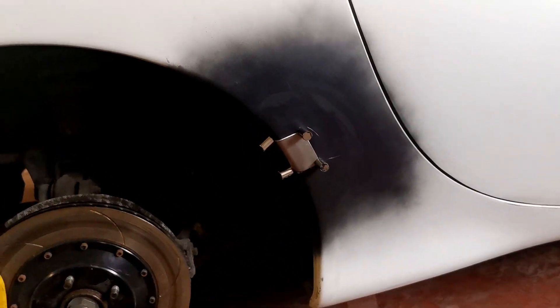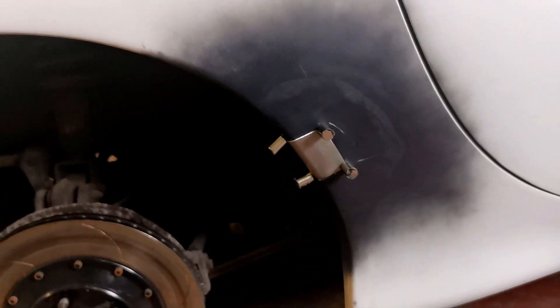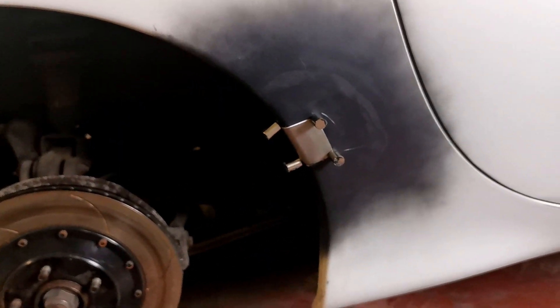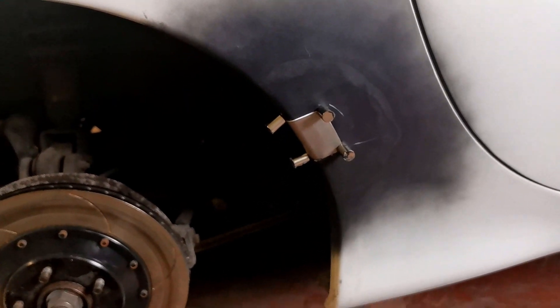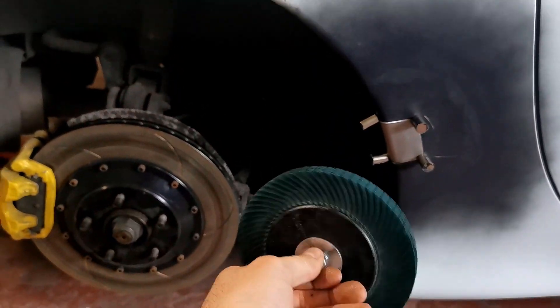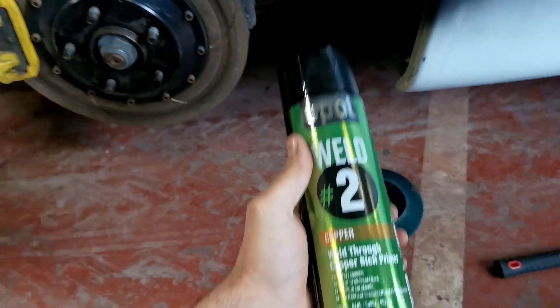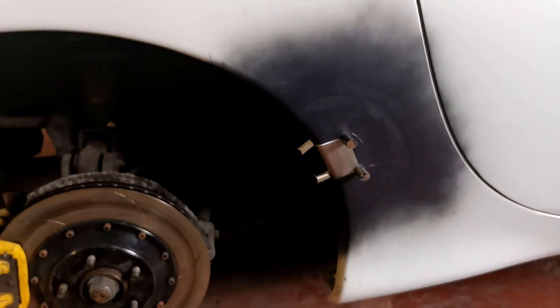Good morning, welcome back — it's now Tuesday. Bank holiday yesterday and because it's the UK it just rained all day, pretty standard. Today we've got the panel in. It took me a little while to make it — I'd rather get it fitting perfectly in metal than slap something in that's not 100% and have to use way too much body filler. We're going to take all the paint off using this 3M plastic wheel that Liam got for the Datsun, then paint it with copper weld-through primer, fire up the Artec welder, and get it welded in.